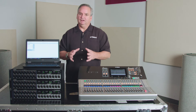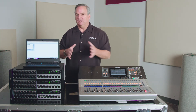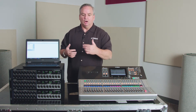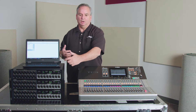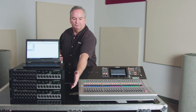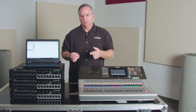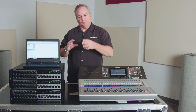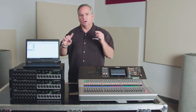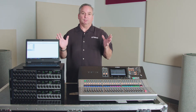It's really easy to set this up, and we came up with the quick config mode to make it easy for that person. All you need to do is put the boxes in that mode — box 1, box 2, and box 3 — and you have inputs 1 through 16, 17 through 32, and 33 through 40, all shipped up to on stage. All your A to Ds are up there, nice and quiet, and it comes back on a tiny little piece of copper.